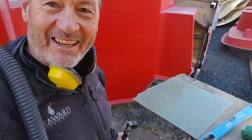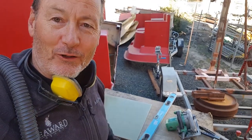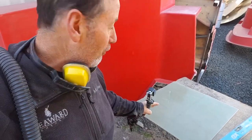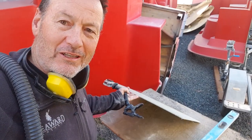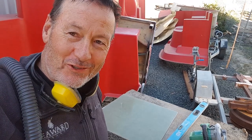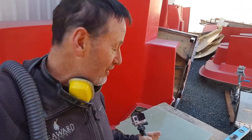All right, well that's now done. There was a bit of an issue — the guard on my saw got caught and I took a little chunk out of it, so I'm probably going to have to do a little repair on that. But it's interesting to see how thick this is. It's nowhere near as thick as I would have imagined, and in fact, how solid it is based on the fact that it's got so much quad and biaxials, and all that CSM mixed in together. Unbelievably tough laminate.